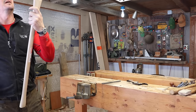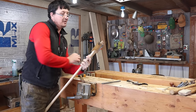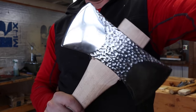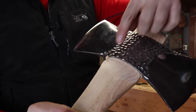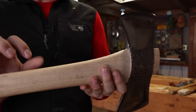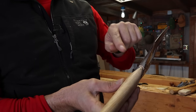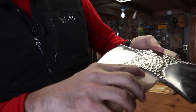That's our last fit — four fits there. So just to show you here, I'm not done with it yet. It's always about the lighting. You can see there we're coming up on the edges. See how we have those equal curly cues? Real consistent. That's telling us we're really driving that wood good into those corners. That's where you see beginners — myself included — where I really fell down. I always had gaps in there. It was so disappointing. But I haven't touched it. When filing, never touch that portion over there unless you absolutely have to.